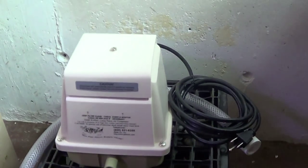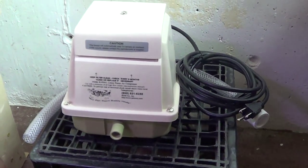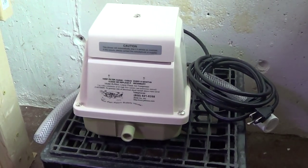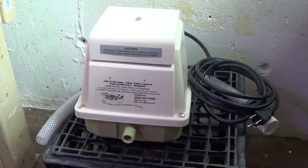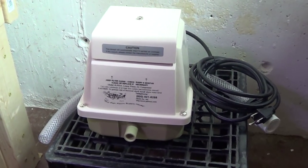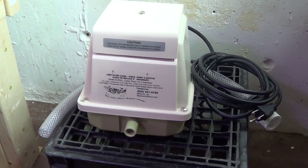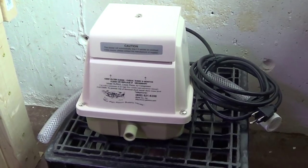As you can see, what I have here is a linear piston air pump for my central air system for the fish room. Typically, people buy the smaller diaphragm pumps. Those diaphragms can crack or break or rip over time. The advantage to a linear piston pump is it's a piston — it's metal on metal, and the air that it can move is much, much greater than anything that a diaphragm could ever do.